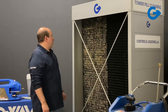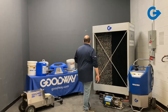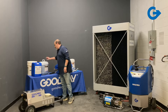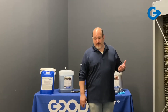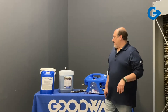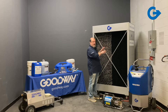So we came up with our TFC 200. This machine is kind of unique — it's a delivery device and rinser made specifically for our chemical product, Scale Break Gel. This is a 5-gallon pail of a de-scaling chemical used for attacking calcium on your cooling tower. What's really unique about it, besides being a de-scaler that's user-friendly — meaning if you get it on your hands it's not going to burn you, you just wash your hands — it doesn't attack the metals or hurt anything in there. It also comes in the form of a gel, so when you spray it on, it sticks and clings to the fill like syrup and stays there, giving it time to react with the calcium and start to dissolve it.